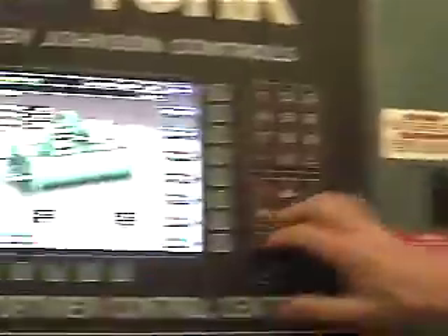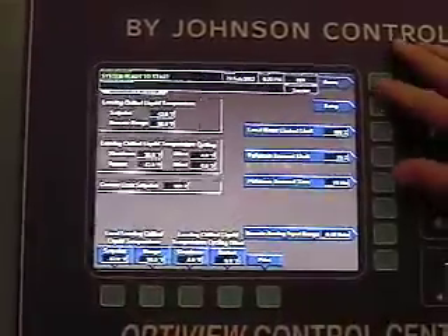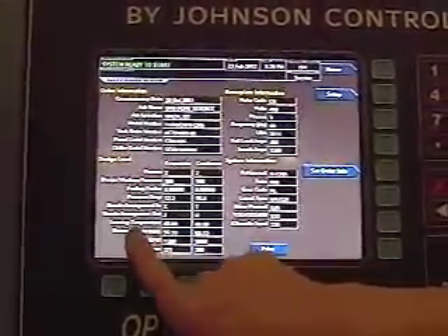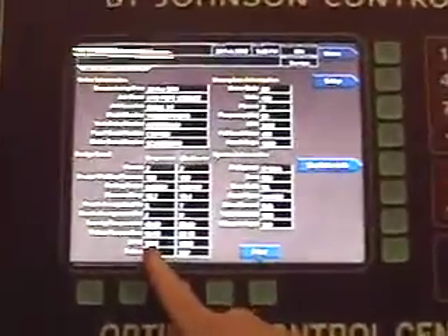This machine is designed for comfort cooling. Right now you have a set point of 43, but the sales order screen shows the machine is designed for 45 degrees. Running at 43, you may still get 600 tons or a little under. The machine can actually run with water temperatures down to 38 degrees or as high as 55 degrees; the brine content in the evaporator is adjusted accordingly for freeze prevention.